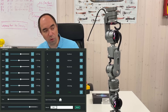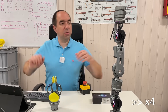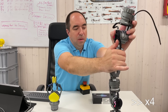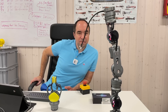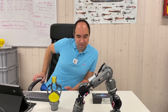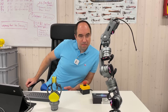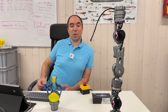With the home button I can move it back to the home position. Let's try the teaching mode, which they call drag-and-record. I moved the arm manually — up, sideways, around — and stopped recording. Then I replayed the file, and it worked — the arm reproduced the recorded motion.